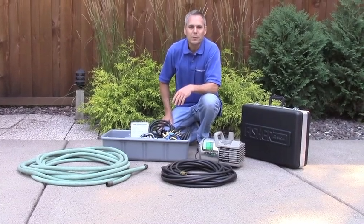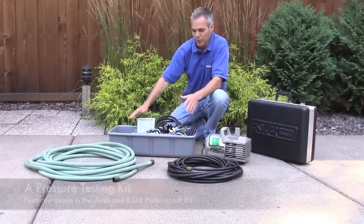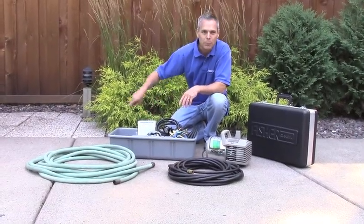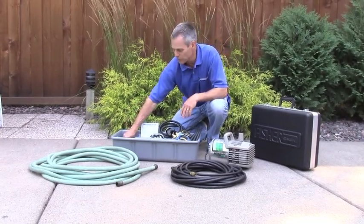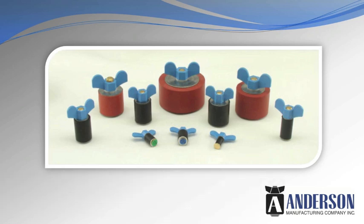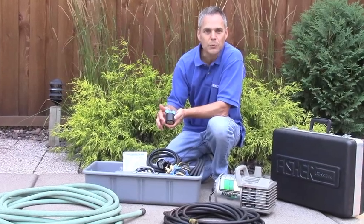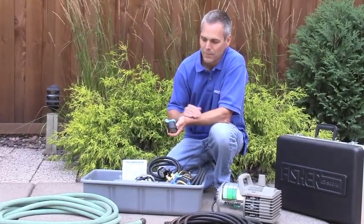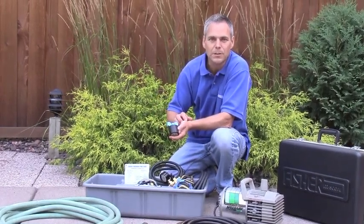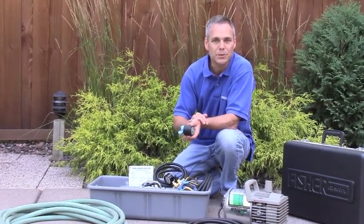We do need some specialized equipment for pressure testing. For the first part of the test, where we're determining if the line is leaking or not, we're going to need a good garden hose and a pressure testing kit. The pressure testing kit gives us all the specialized tools we need for blocking off the plumbing line so we can determine if it holds pressure or not. The first part of a pressure testing kit are closed plugs, used to put into the openings of the plumbing where we want to block the line. This is a standard open stem plug. What's important about all the plugs you use is that they have a straight-sided piece of rubber so you get a good strong seal inside the pipe. They have a large wing nut so you can easily torque that rubber down to expand it inside the pipe, and they have good corrosion-resistant heavy-duty hardware so that the plugs will last for years and be tools that you can depend upon.